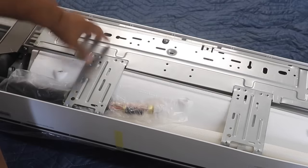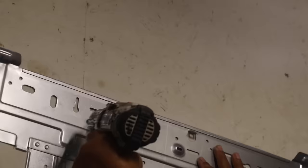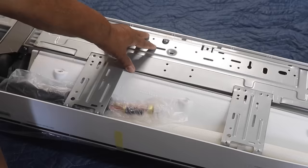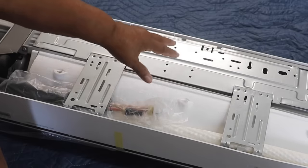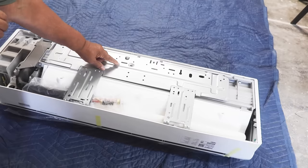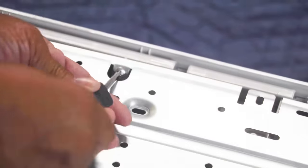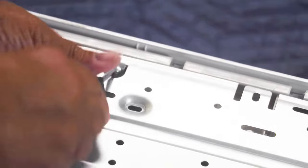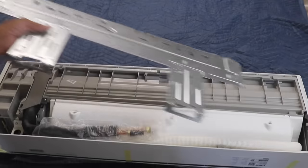What we're going to do is we're going to first remove the mounting plate, because we're going to have to attach this to the wall — it acts like a cleat, and it's going to allow us to rest our evaporator right on this mounting plate. To remove the mounting bracket or plate, there's just one screw right there in the center. We're going to remove it and the bracket will just lift out of the back. Now we're ready to install it.